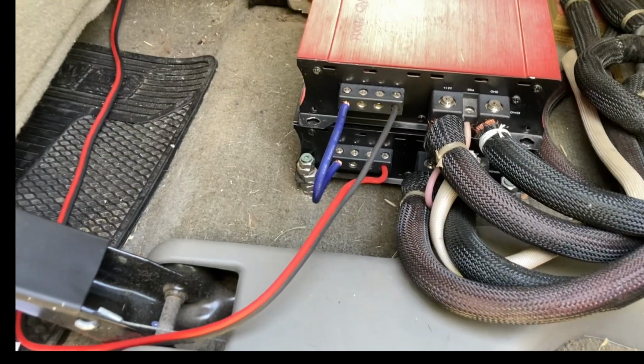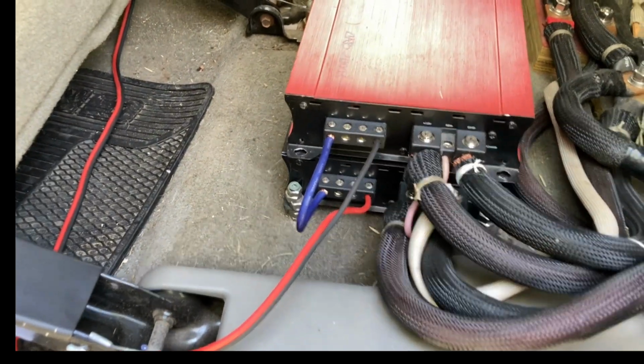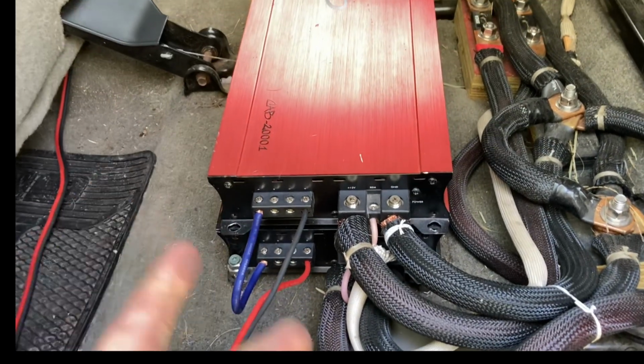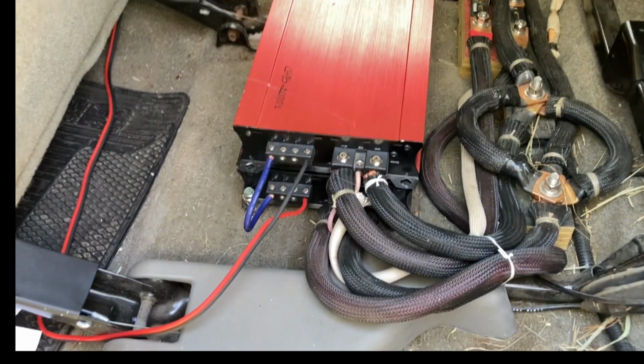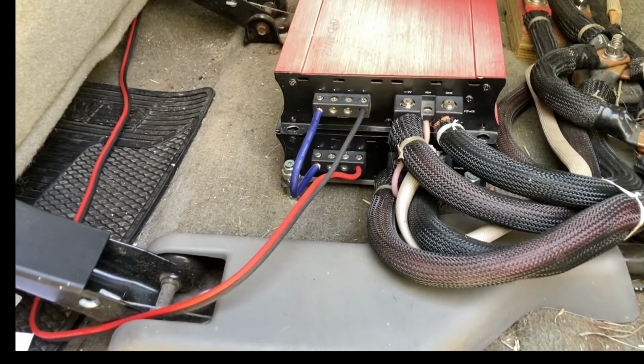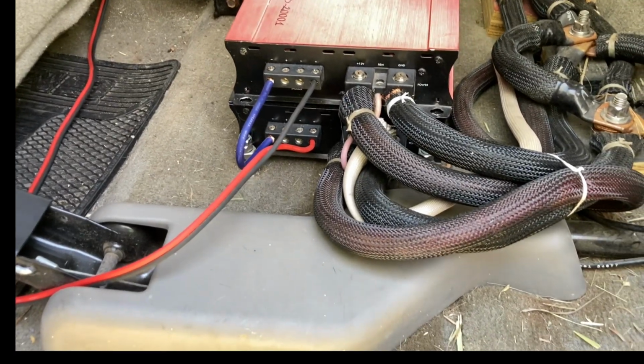Yes, this is off the 2k ABS. This is strapped, so if that's a 4 ohm load, what does that equal? Each amp seeing 2 ohms. Well, at 2 ohms, each of these should make close to 1,000 watts. Now, I wasn't giving it the full level, obviously, since my stereo system doesn't really come alive until like volume 50 for the subs.